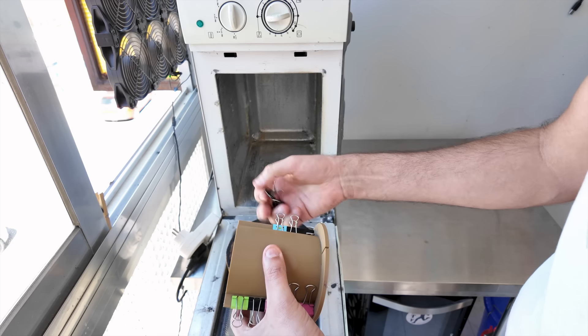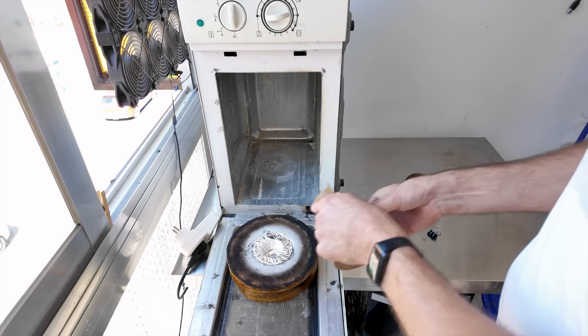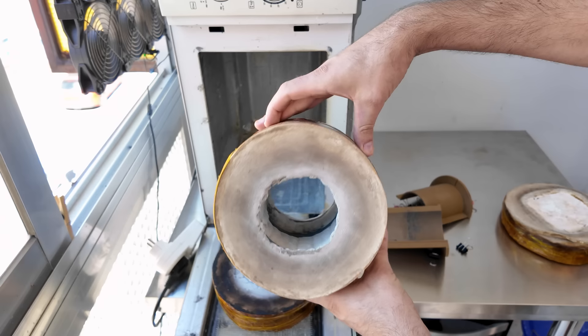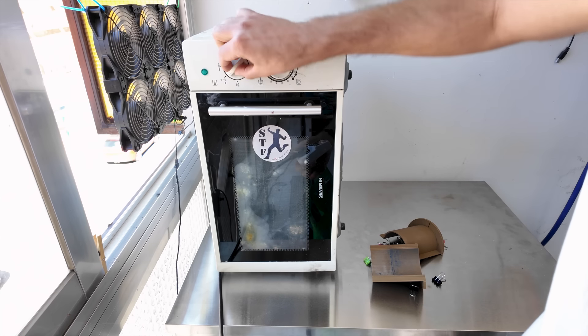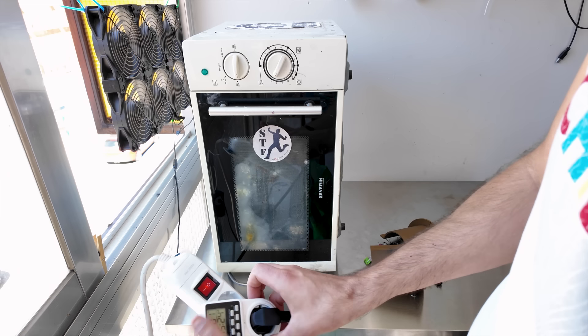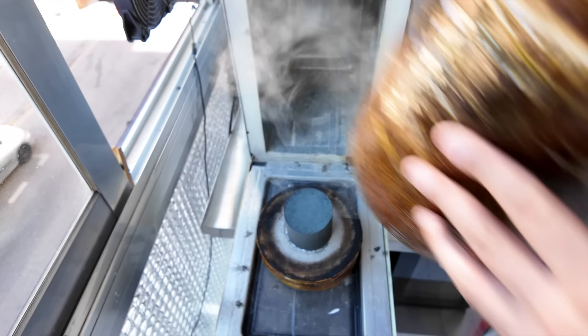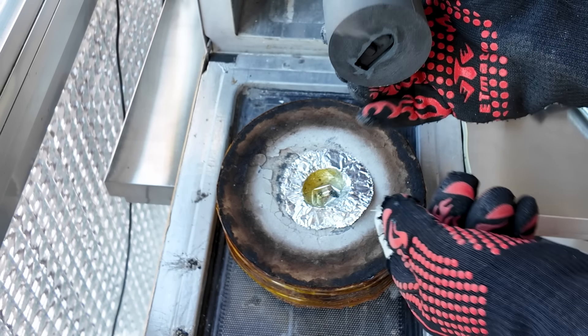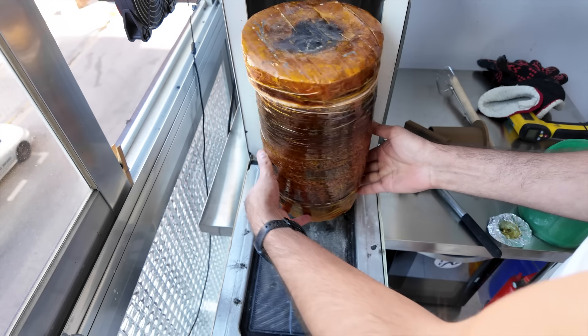Because I lost some footage I had to make another mold to show you all the steps. This time I printed the Benchy in translucent PLA because I think it burns out better. This mold I froze for one hour. I'll use my microwave kiln to burn out the mold, but first I need to cure the sodium silicate and I'll do it by running my microwave on low power using an interval timer — one minute on and six minutes off. After half an hour I turned up the power to 300 watts, and after another half an hour to full power. After around two hours of microwaving the mold I removed the foil full of molten plastic. At this point there's not much plastic left so we can just microwave the mold for a few more minutes and it's ready.